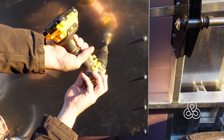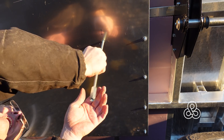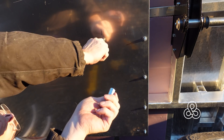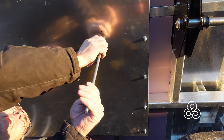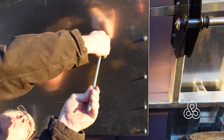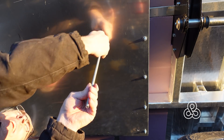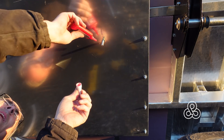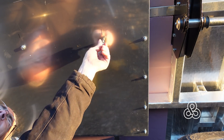I reduced the size of the gray water tank and it is only about 26 inches from front to back, so it did not need a center brace. I do have threaded rods in front of it and back of it. If I have any problems, I can just run a strap underneath the tank for center support. We'll run those threaded rods in and put a washer to spread the weight out, then tighten those nuts up just to get some pressure onto that sheet metal. These tanks are now very secure with multiple bolts along the side rails and braces through the center. This whole subframe is ready to lay down flat, pick up, and get the chassis underneath it.